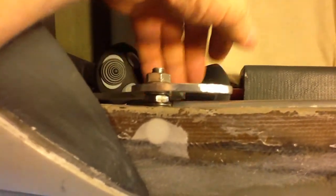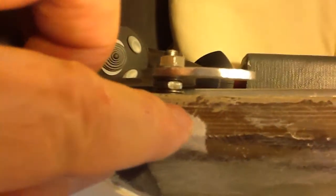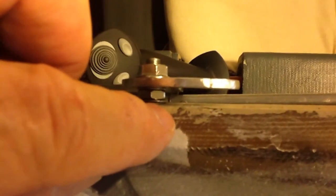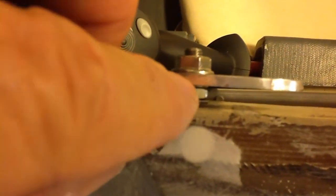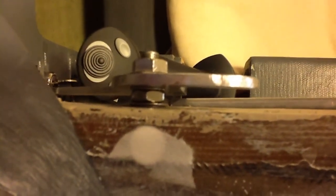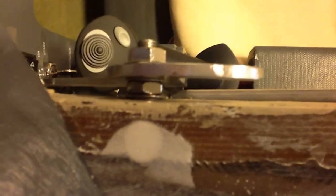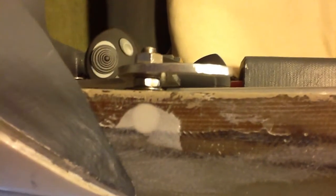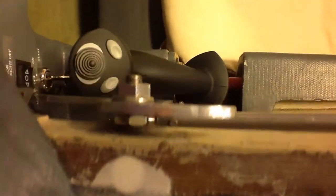Here's a better angle. Inside here there is a sleeve that is a clearance hole — three-eighths OD and quarter-inch ID — for a stainless steel socket head cap screw. There's a washer, a jam nut, and an external star lock washer against the aluminum arm. The aluminum arm is threaded inside — it's 10-32, which is an AN3-type thread — so you thread the bolt into the arm.